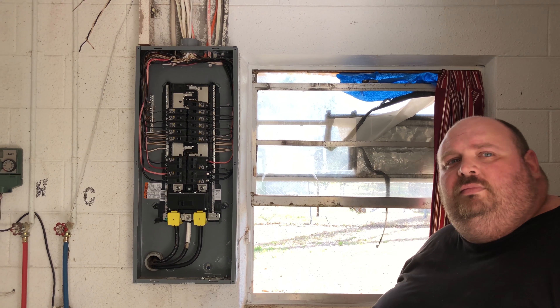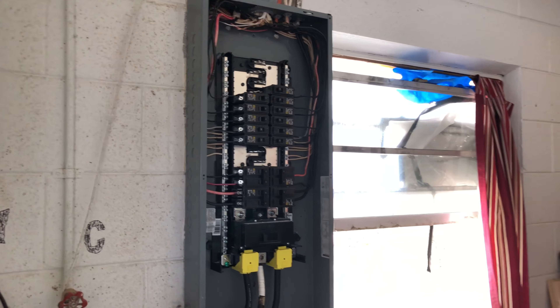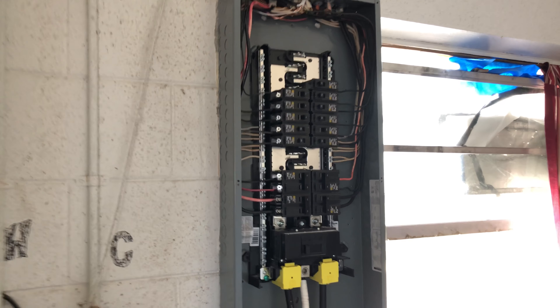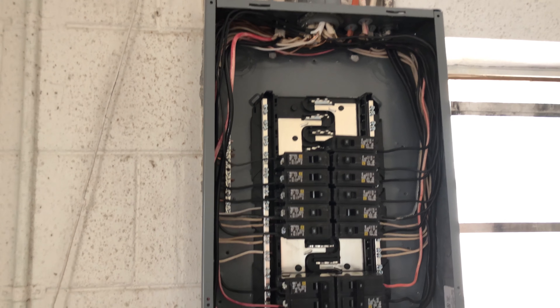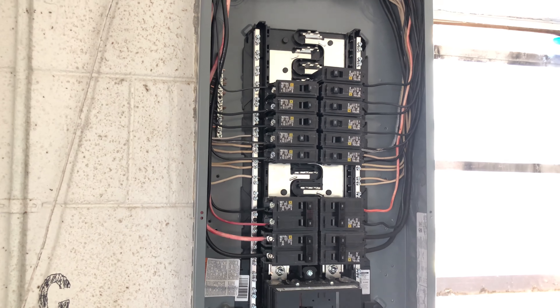I was thinking I needed to go from a 150 to a 200-amp panel — that's the advice I got from another guy. But when he came in, him and his dad said, 'Hey, we don't have to do that. All we need to do is put in the same 150-amp power but put in more breakers — we just need more circuits.' That 150 is more than enough to cover you up to probably a 3,000-square-foot house. It's about the power you're demanding. If you've got a pool, five bedrooms, a two-car garage with a welder, then let's talk about getting into a 200-amp panel. We don't need that here — 150 will save you some money. Let's put that money back in the house somewhere else to give you more value.